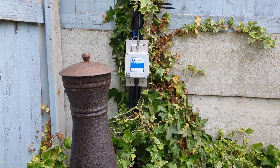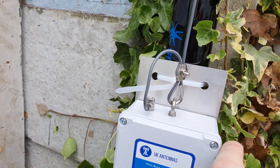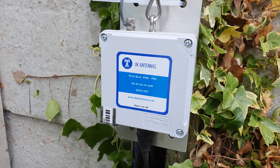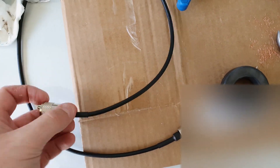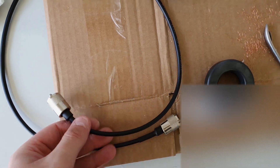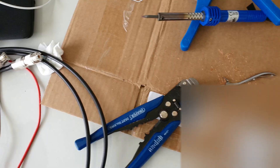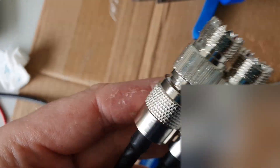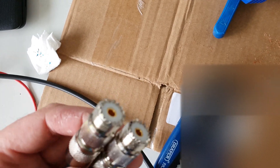It'll be two and a half meters of coax up to the antenna. I'm going to take that plug off and do a better job of the waterproofing. Ian did say the back plate is aluminium and that raising it away from the plate a little bit would help the SWR, but it's pretty good as it is. Now I'm making the toroid - this patch lead has the plastic dielectric so when it bends it's not going to migrate to the shield. The two and a half meter patch lead is done with barrel connectors heat-shrunk on there.